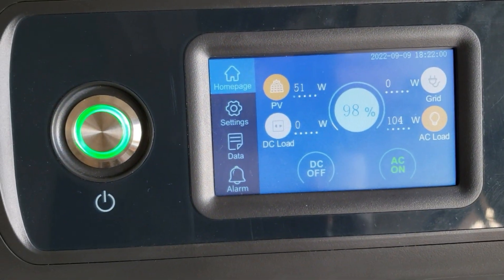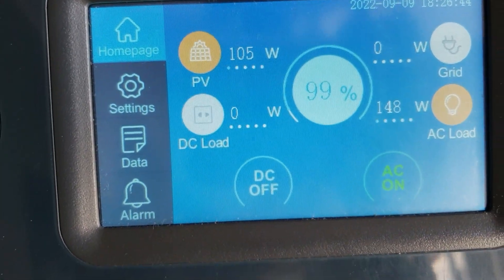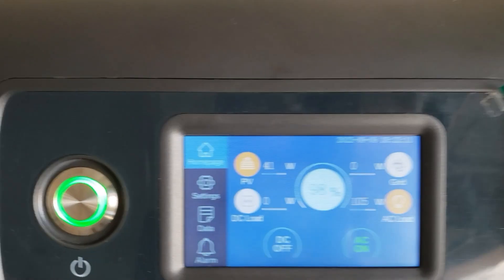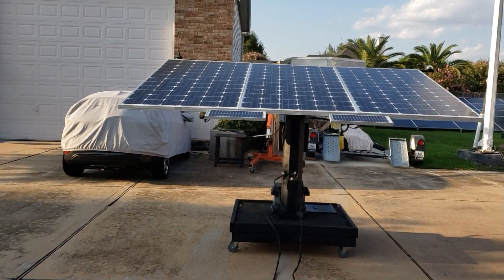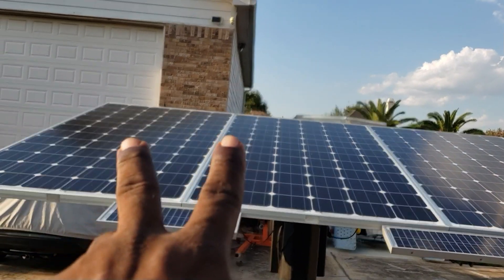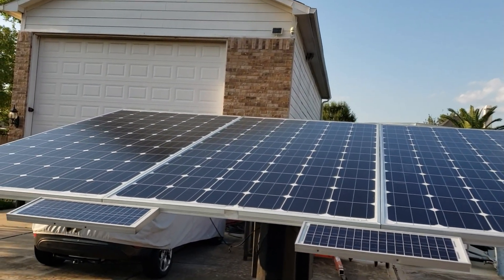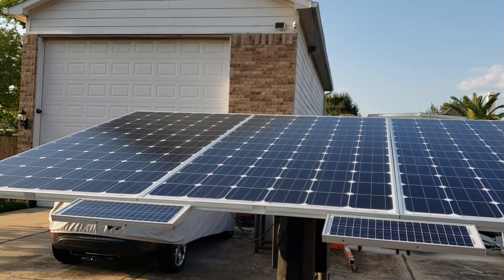This one's on 98% pulling right about 104 watts. This one's at 99% pulling 148 watts. You can see I have solar coming in right here. This one has two solar panels on it, this one has one solar panel — and I'll show you why. I have my solar tracker connected to it, and because I have three panels I have two in parallel and one by itself. I had four but one's on top of my RV right now, so I can only put three on the tracker.